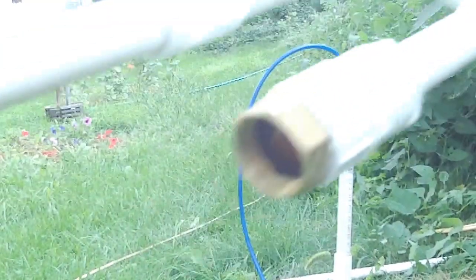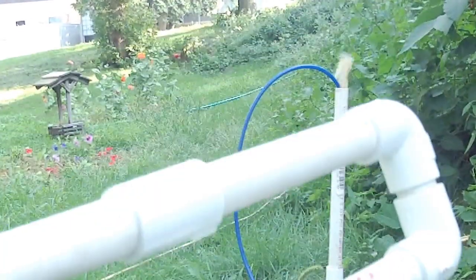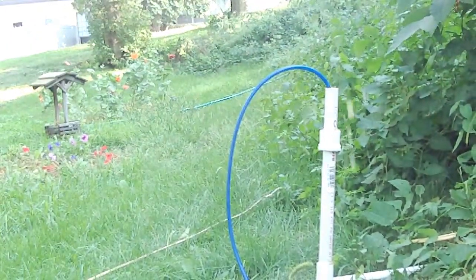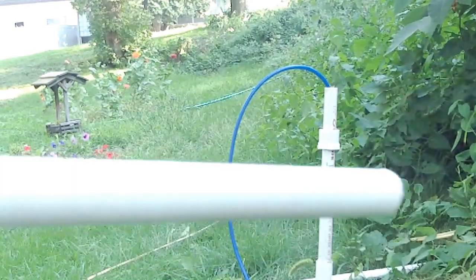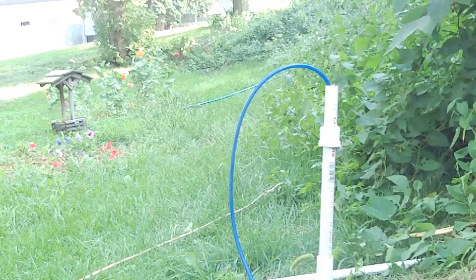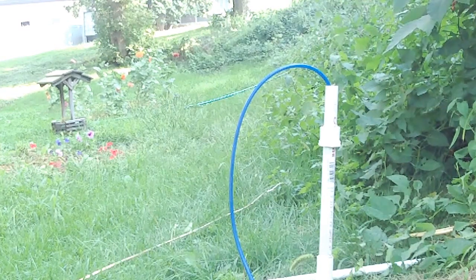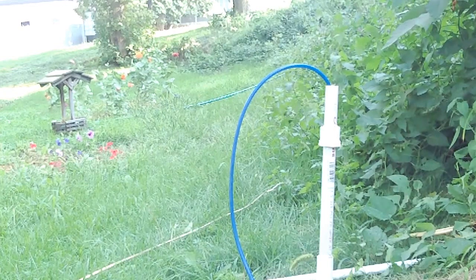I just used to set up something like this — it's just a brass fitting that allows you to hook it onto a garden hose, a couple 90s, half inch PVC. This is about a six foot piece. Hook it up to the garden hose, stick the end in the ground. Using the water pressure it will basically erode its way into the ground.